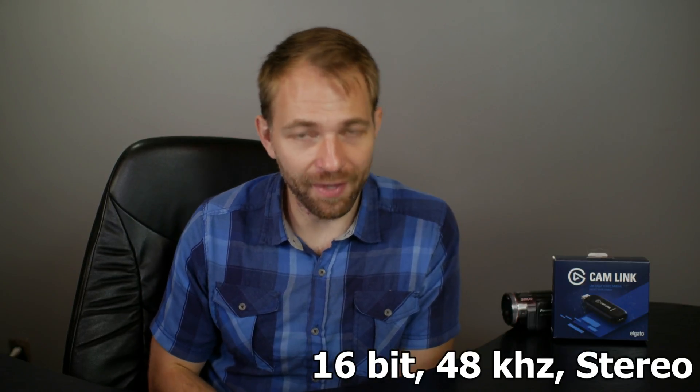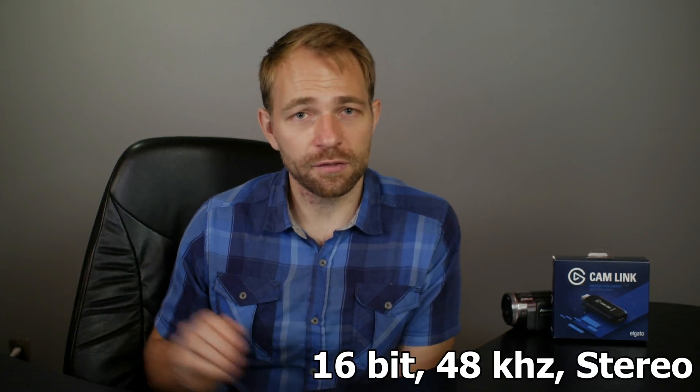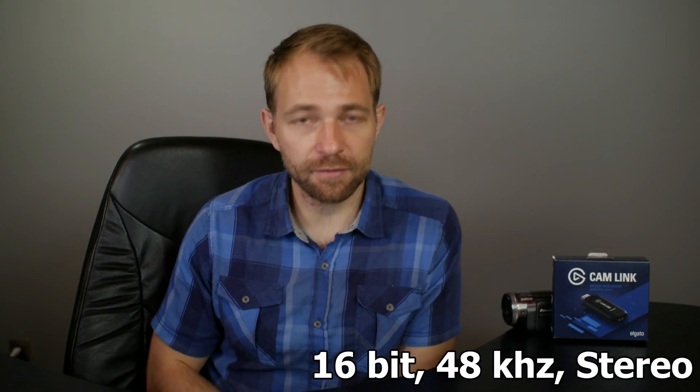The audio was also fixed. The G85 was outputting 2-channel, 16-bit, 48 kHz audio — that's what I was detecting in Cam Link. That's reasonable, though it's not 24-bit, and it's not really that great. It becomes even worse because I was using an onboard microphone when passing through the data over HDMI, and not many cameras have a mic input or line input.